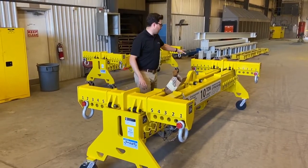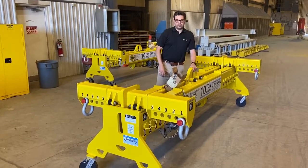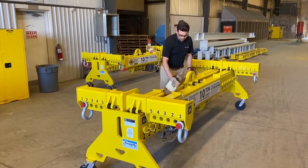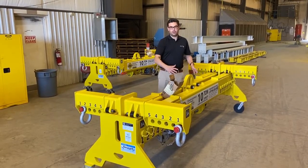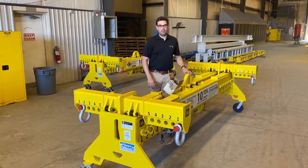This is the same at both ends. The other adjustability point we have is the lifting bale itself. It is adjustable along the length of the beam, which is powered by a hand chain and acme screw that will allow the operator to move the bale to help center their load and keep the center of gravity below the lifting bale and keep their load balanced.